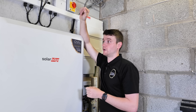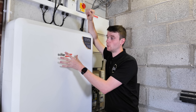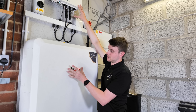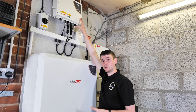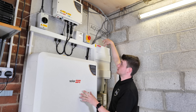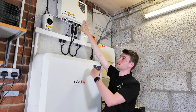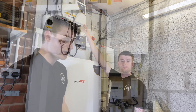It's just another great reason why the SolarEdge battery is a fantastic piece of kit. We can charge and discharge this battery at a maximum of five kilowatts directly from DC, which is a slightly more efficient charge than going through a second battery inverter. However, we can only discharge through the inverter — so if you've only got a 3.5 kilowatt inverter, that's your maximum discharge rate. If you have a 5, 6, or 8 kilowatt inverter, you can charge and discharge at the full five kilowatt maximum.